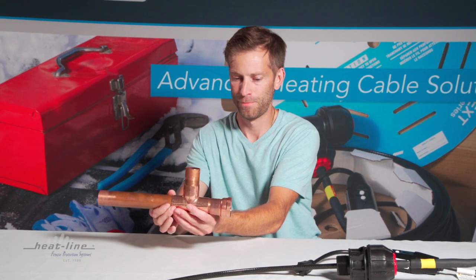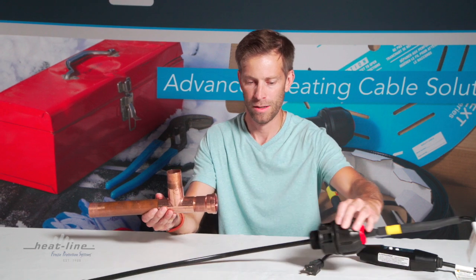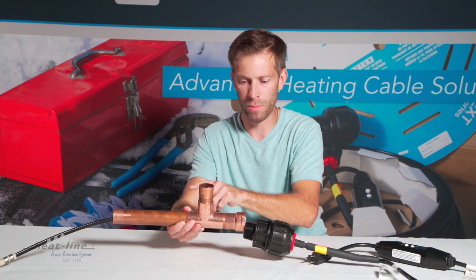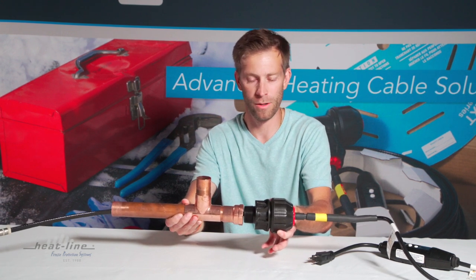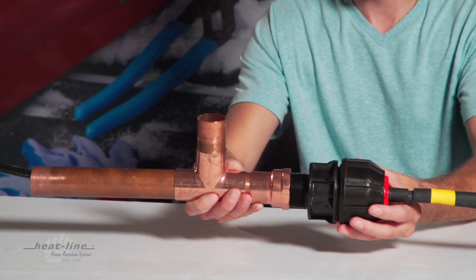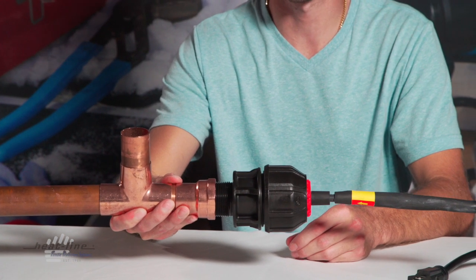With this setup, we can easily introduce the inch and a quarter thread connection on this particular Retroline IP system. We then feed the heater through the horizontal run. The reason we did this, as opposed to introducing through the branch, is we would not be able to easily pass that product 90 degrees through that T — so it makes it much easier to do it from the side. Then we feed the Retroline into the copper assembly and the male thread will connect directly to the female thread found on that copper assembly, providing a complete pressurized connection in a copper pipe.